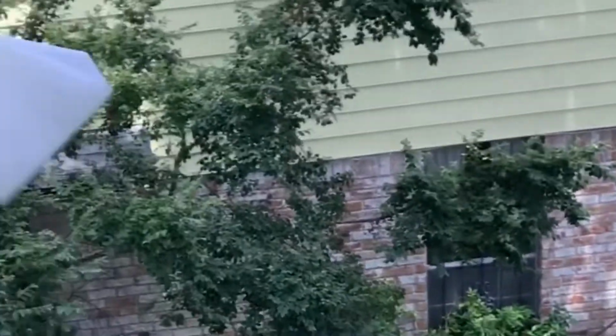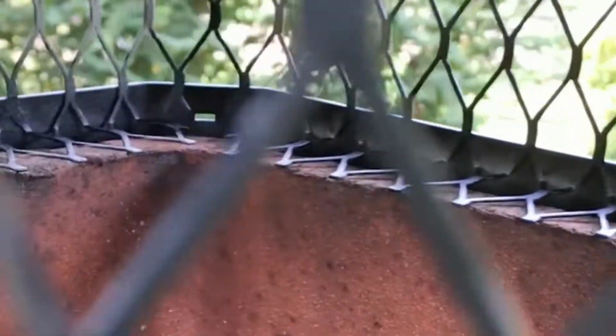So if you're already back on the roof, you're standing next to the fireplace and you have the chimney cap in hand. Generally these chimney caps and the flue tile is extending. Very easy, look at that. You go ahead and put that over the clay flue tile. I don't know if you can see in there, but that screen that flanges out is sitting directly on the top lip of this flue tile. And there's a little bit of play, that's normal.